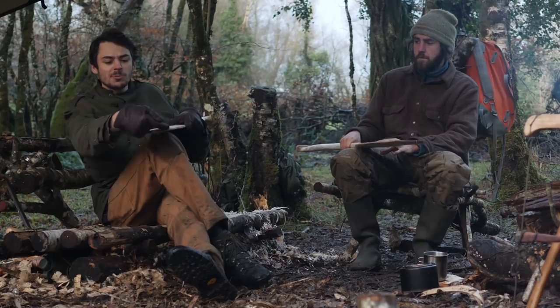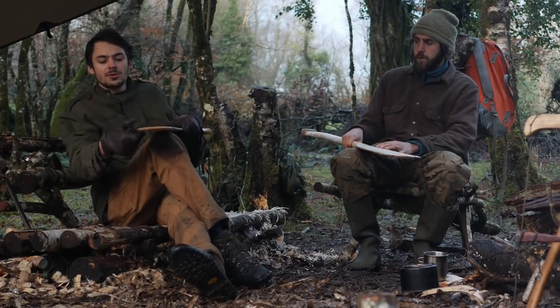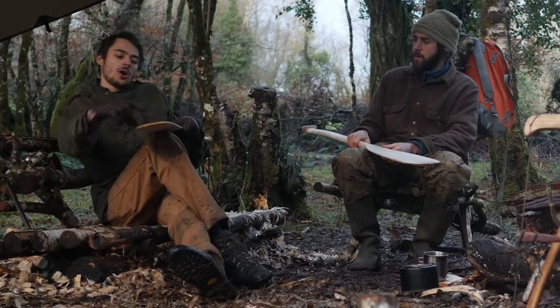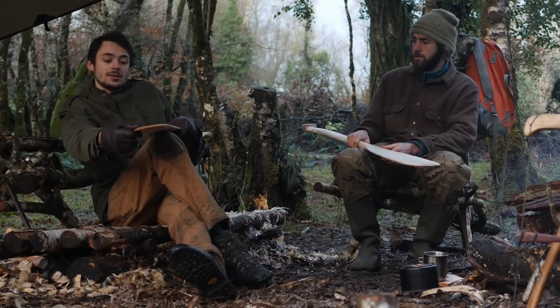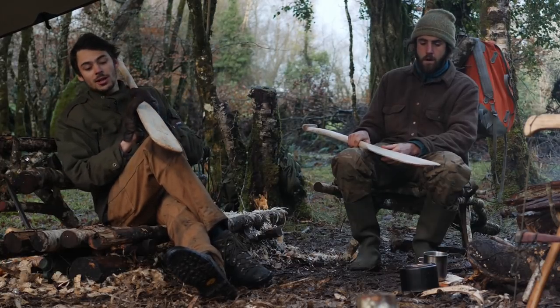You know, you preferably want to have the grain completely straight into the paddle, so the sides especially won't get off with the skin. Yeah. But you need a very thick log to accomplish that. Almost double the size of your paddle to have them perfectly straight in. So the sides here might be a little fragile. But we'll see how they hold up.